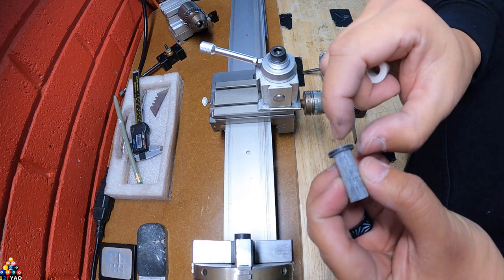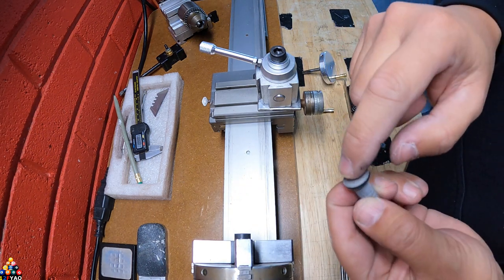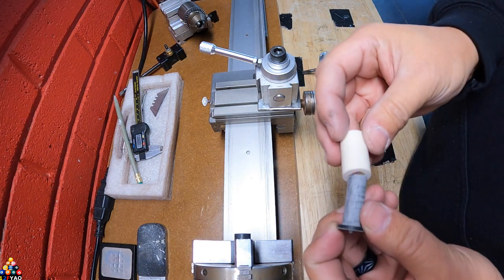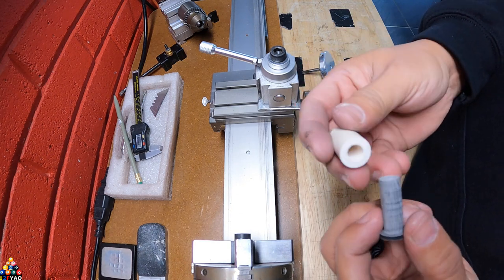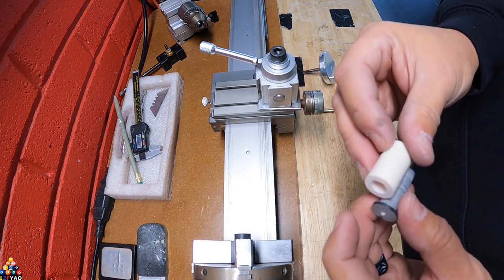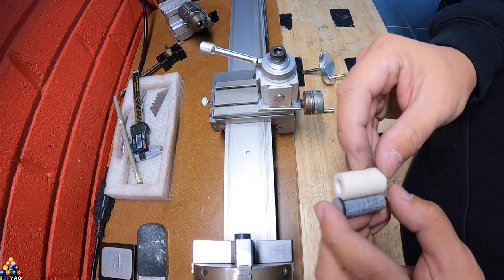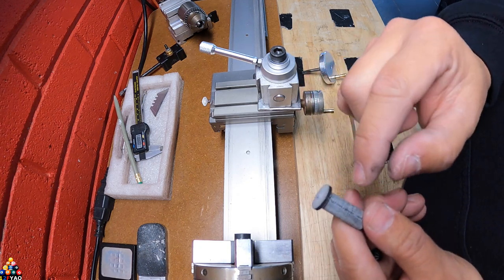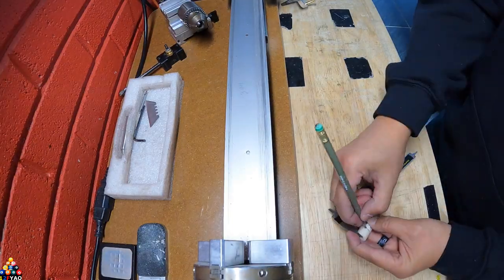Now the G10's cut, so this will be the bolt plate. You can see how it's a plate. I'm gonna cut this little thing off, make it flush. And if you notice, this is the size for the carbon shaft. And now I gotta get this and bore this out so it mates inside and get the proper length measured so that once I insert it, it'll be the same length as the original shaft.